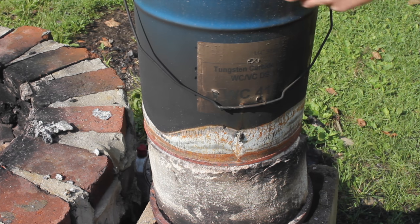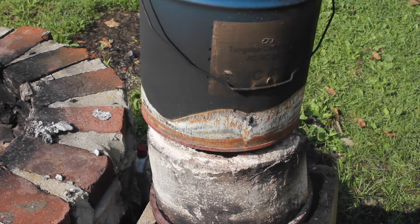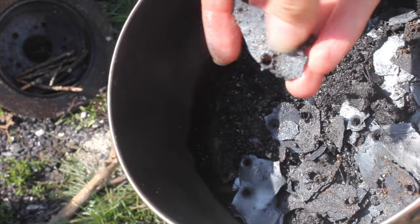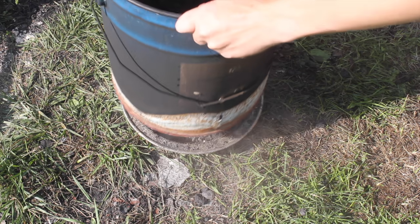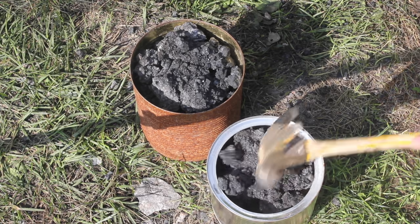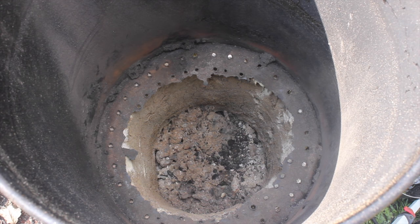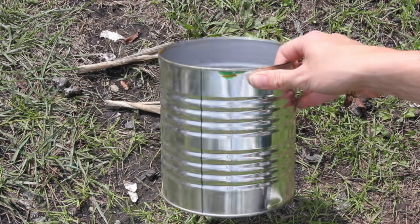The next time I tried to make coke, the bottom of my steel can melted off because I tried to speed up the process by adding coal to the fire. I found some fragments of the can at the bottom of my forge, and they were just as brittle as potato chips. I shook all of the loose fuel out of the can and onto a dish, then put the larger chunks into a set of cans and crushed them with a hammer. It probably would have just been best to use a wood fire, which is easier to control. I didn't have any more 5-gallon steel buckets, but a steel food can like this should work just as well for making coke.